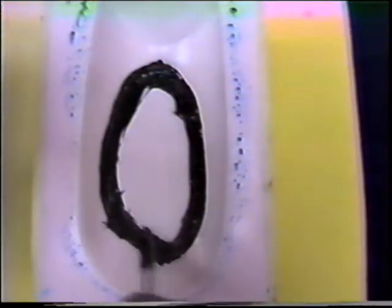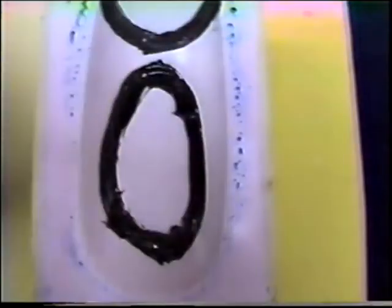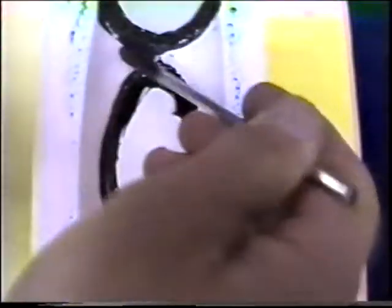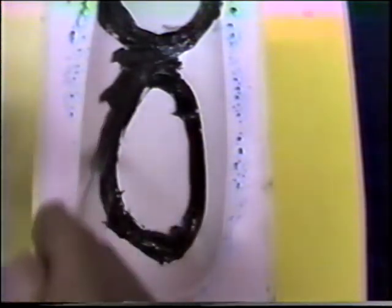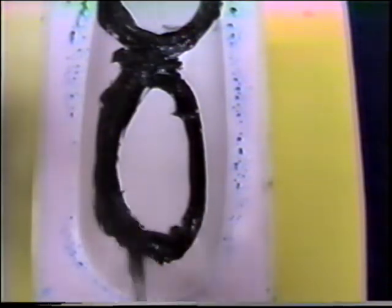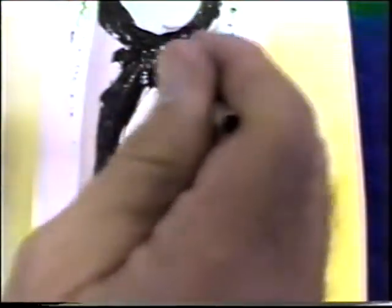Now see what happens, this stays in the corner. It retains its shape. It's thixotropic. Thixotropic means it doesn't drip and run down. And in theory, it should be just a little bit lighter, since less of it is resin and more of it is actually chop. And you could chop up all your scrap fiberglass, the scrap that you normally throw away. You can turn it into useful stuff this way.